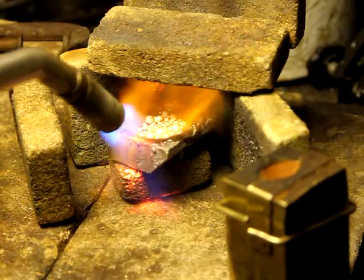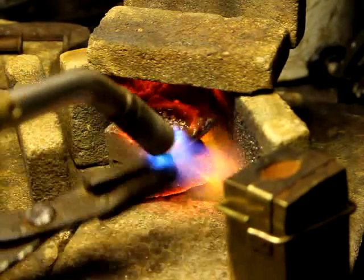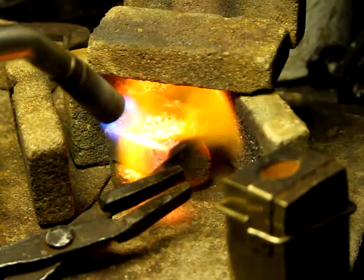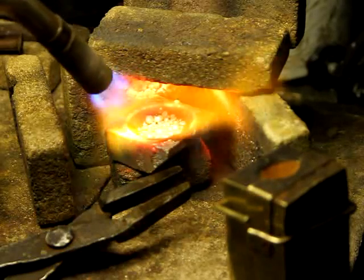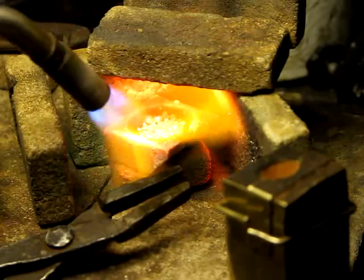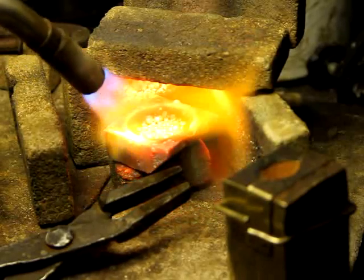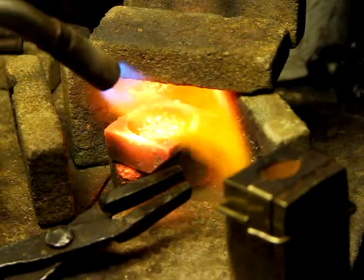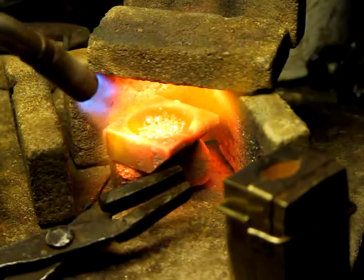So the approximate amount of silver is in the crucible. I'm going to have the tongs in the vicinity of the heat to heat up — I don't want them to suck heat out of the crucible when I'm about to cast. The mould is ready. I wouldn't normally have the mould here, but for the sake of the video we're putting everything a little bit closer together. You can see I've built little walls and a roof around the crucible to reflect heat back in. I'd normally have it even more enclosed, but so you can see what's happening, I've got it open. Probably a little bit more gas than what I need at the moment, but I'm just heating everything — we'll focus a little bit more on the metal in a second.